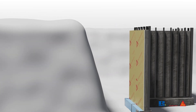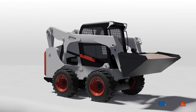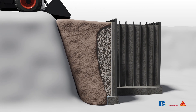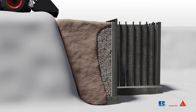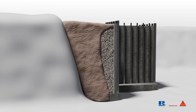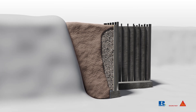Finally, it's possible to install the boards without attaching them to the wall to save on material and labor. Coordinate the backfill to be installed at the same time as the insulation, and use the weight of the backfill to hold the insulation in place. If you follow these instructions and tips, you'll be well on your way to a successful below-grade insulation installation. Good luck!